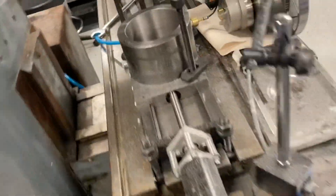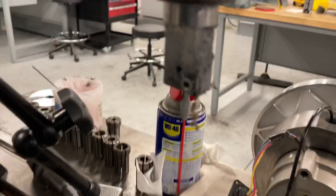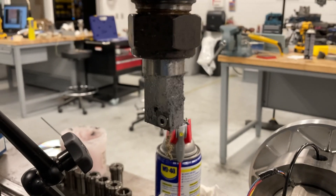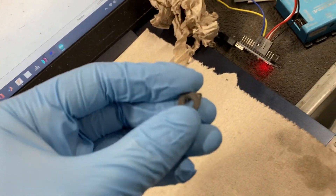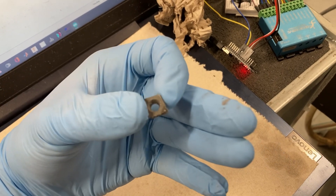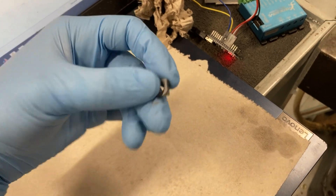So the spindle's on the table there, and then of course the tool is held in the spindle. There's still some residue on it, but you can see this is our PCD insert here — and a little custom tool holder I made just earlier today to use it on this mill. Here's another one of those inserts. They're pretty sharp, but they're not MCD by any means. So the fact that we were able to get this finish just with PCD bodes pretty well for future experiments.